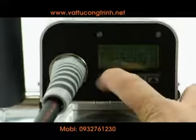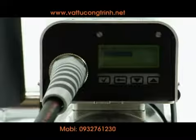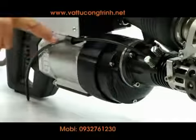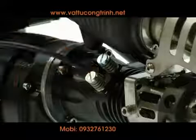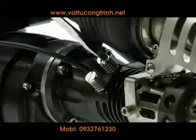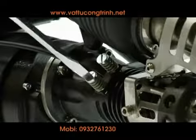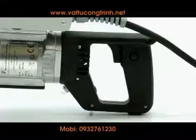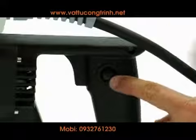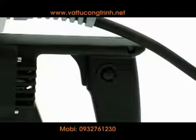To cool down the gun, push the back arrow button for the main menu. Welding rod feeds into the extruder from the side of the barrel. Two adjustment screws help control the feed for different size rod, as well as softer rod. The trigger lock button is located down on the handle — push to lock the trigger in place. To unlock, squeeze the trigger once.